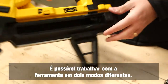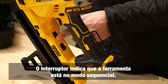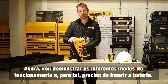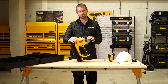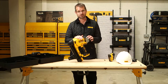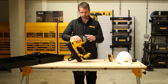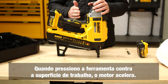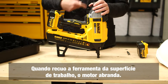The tool can be operated in two different modes. With the switch in the lower position the tool is in sequential mode, and moving the switch up puts the tool into rapid cycle mode. To demonstrate the different modes, I'll insert the battery — I'm not going to fire a nail as there are no nails in the tool — and push the tool down against the work surface so the motor spins up to speed.